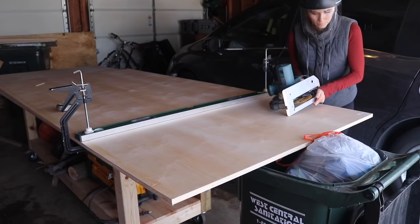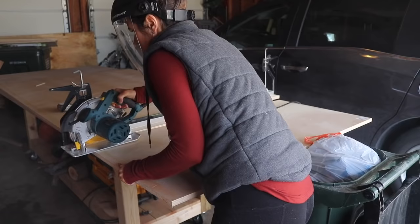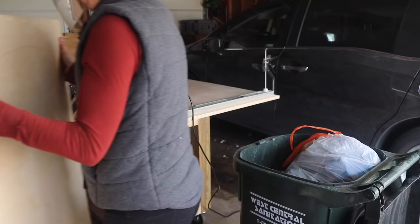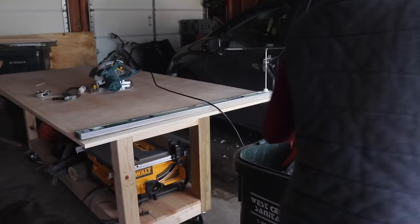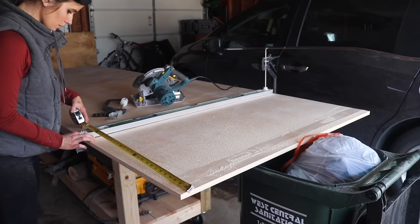The first thing I'm going to do is begin building a built-in closet drawer system for this space to make it way more functional and add a ton of storage. I bought three sheets of three-quarter inch thick birch plywood, and everything I build out in this closet is going to use these three sheets. I was very careful with my cuts — there was not much plywood left over by the time I was done. I'm using my circular saw and then my level as a straight edge and clamps to rip down all this plywood.